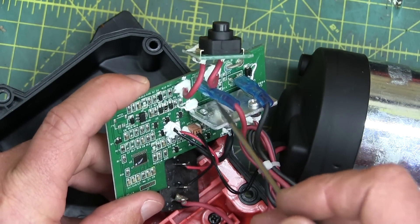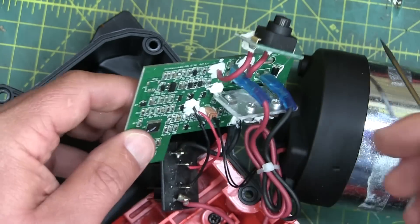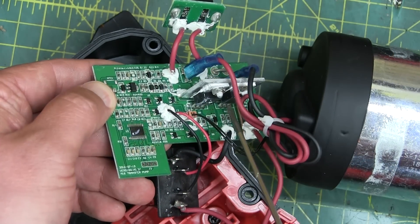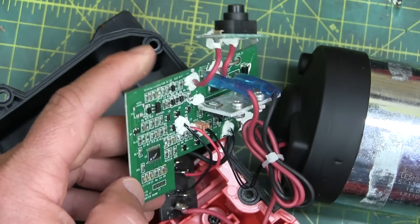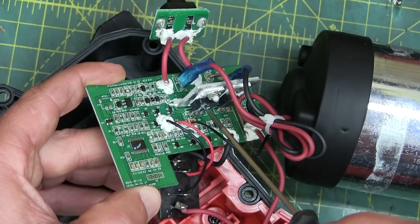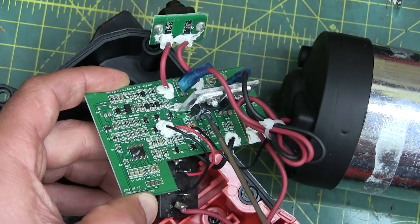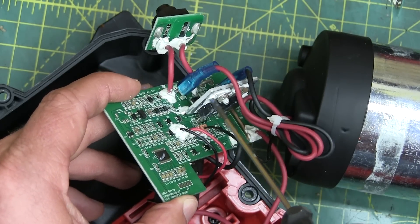This is nice — they're using these expensive Stacons, but they should be heat-shrunk and they're not properly. So that's too bad. A couple of current shunts here. This isn't doing any real switching — you're not doing off-on-off-on. All you're really worried about is just on. It's in a totem pole configuration — you could do it with one, but this is a more robust scenario.